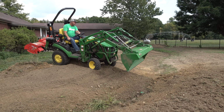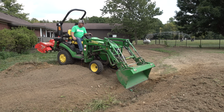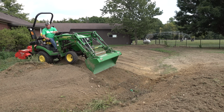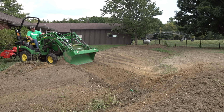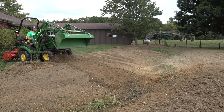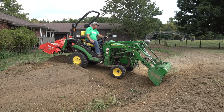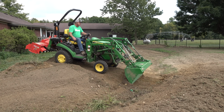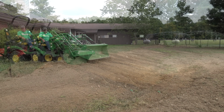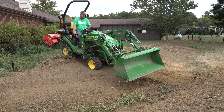When I first saw the project, I thought that was a mistake too. But after I understood the first contractor's solution, I realized this is exactly what we needed to be doing. He's created this other drain here to drain the water that comes next to the house. Meanwhile, this levee, or big ridge that we've got here, is helping to protect from those biggest flash floodwaters, I'll call them, that come in during those big spring rains. Having said that, right on this corner, I think I'm going to have more dirt than I bargained for. We'll probably have to get some of it out.